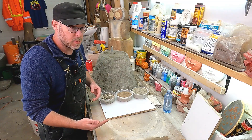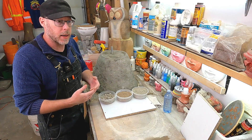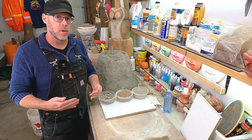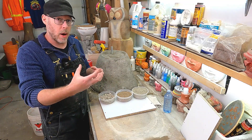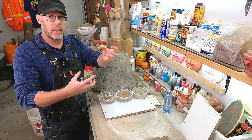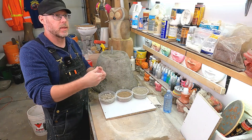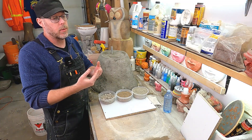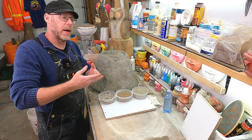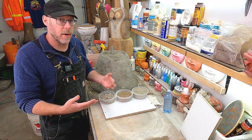And whilst the cracks are not large, they are there and they need remediation of some kind, but they're small. How do you do it? Normally you would chase the cracks with a grinder with a concrete cutting wheel attached to it, and you cut into the cracks to expose the crack deeper, but also allow a larger area such that you can apply a repair of one kind or another.